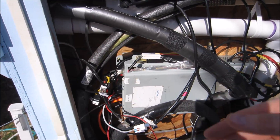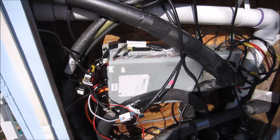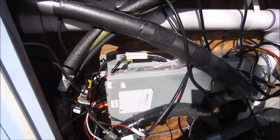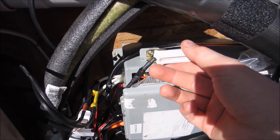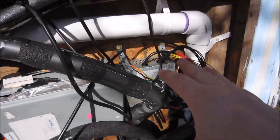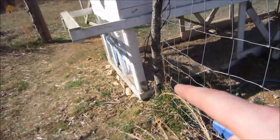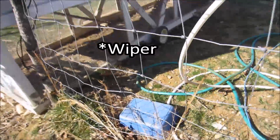We have our Raspberry Pi 2 talking Ethernet going to a router. I can potentially do some port forwarding and access it over the internet. I also have some other strategies like sending email commands. Right here I have a heavy-duty resistor — it's only half an ohm — but it's just enough to stop this low-end power supply from tripping when high amperage is pulled from the windshield washer motor.